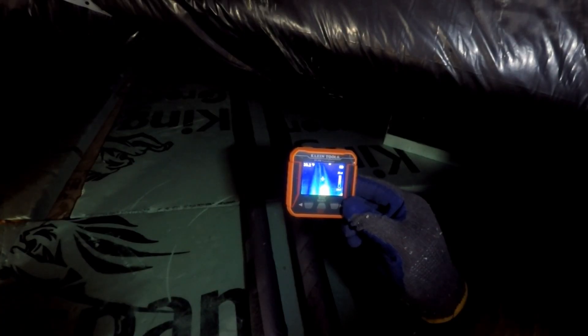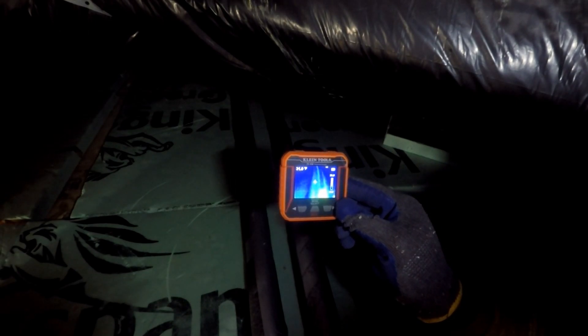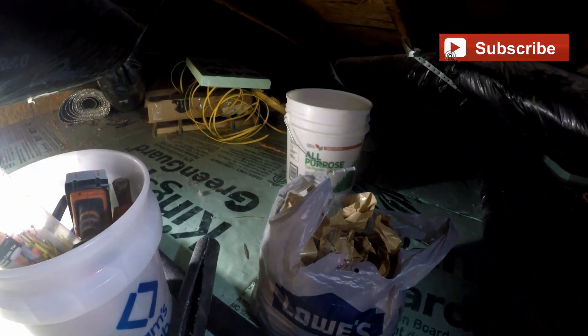What would I do differently? The heat tape was 120 feet in length — I would use two shorter runs instead, making it a one-way run. One last thought about working in the attic: there may be nails in the joists, so prepare to remove them. Knee pads do help, but bulky ones do not. I ended up using insulation for knee pads. A mask is definitely not optional. A two-gallon bucket and a trash bag are preferable.